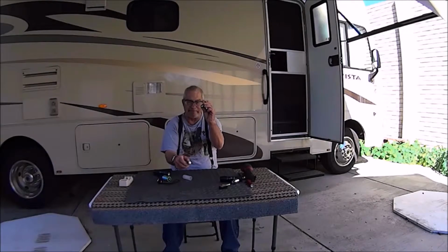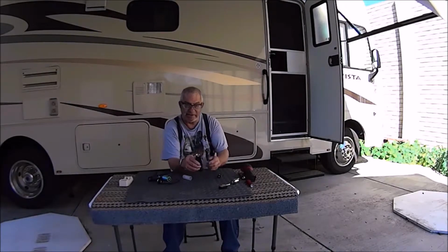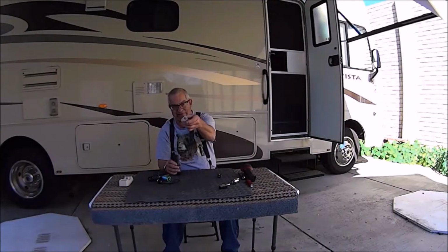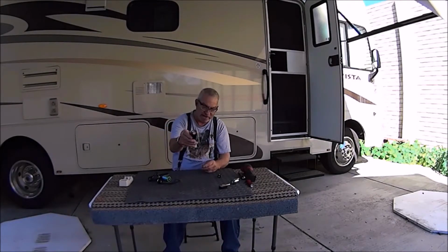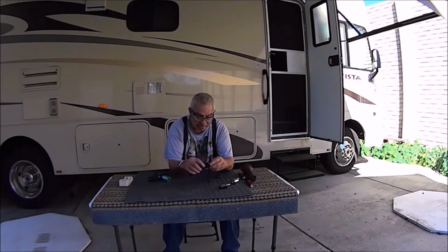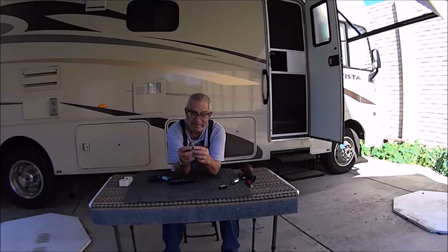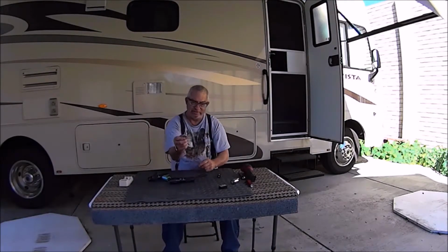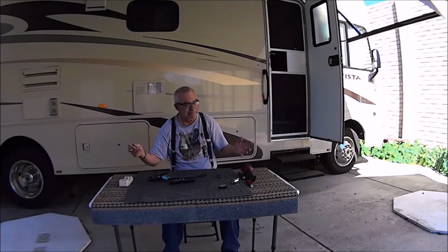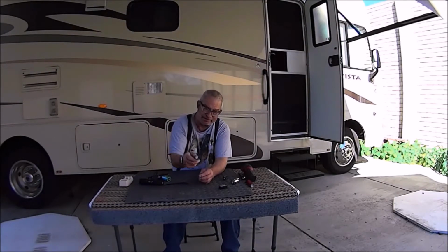Now, the 3-pack is fatter than this battery. So if you put this battery in there, it flops around. So they give you this plastic tube, and all it is is a shim. Now it doesn't flop around quite so much. And again, double check. Yep, got the right way. Oh, I tell you, I was going to say rule of thumb, but no, I mean it's law. It works each and every single time. On a battery, especially one like this, a single cell, the button is always positive. Always. Unless there's some weirdo battery out of Asia that I've never seen before. But even these ones I'm buying, and these are kind of weirdo batteries out of Asia, they're exactly the same. And the flat side is your negative.